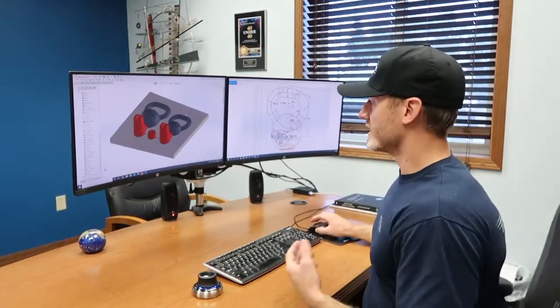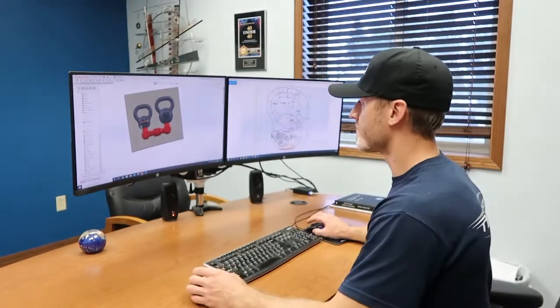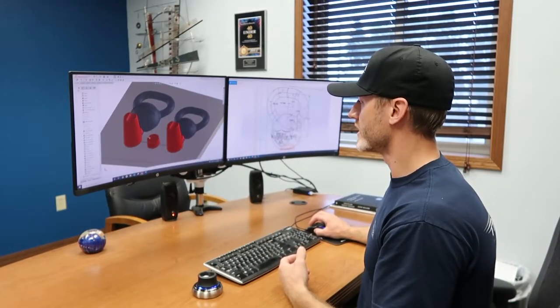Once we have the 3D CAD model, we have to design our tooling that we use to make the actual sand molds that we pour the iron into. When that molten iron cools down, you have a kettlebell casting. I've got both the 18 and the 11 on one tool, so every time we run a mold we're going to get one of each part. The iron flows into this — we pop off this down sprue in the center, and the iron will flow down through here.